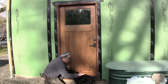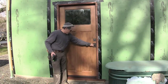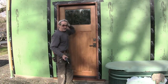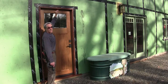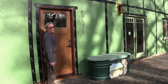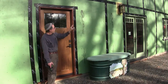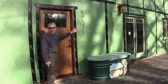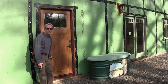I got my door up. I just got the door shoe on it — it locks and it latches, and it's cut off at exactly the right elevation. Being a finished carpenter, I'm a stickler for details. I wanted to be sure the top of this door was level with the Milgard doors and windows I installed on the rest of the shop. Those units come in at about 80 and a half inches in height, which is why I ended up having to cut an inch and a half off the bottom of this Plastpro door.